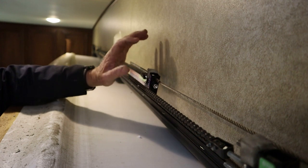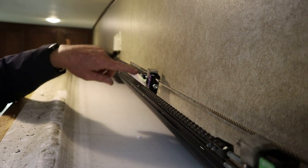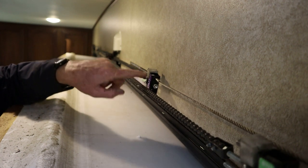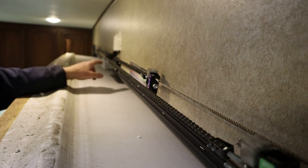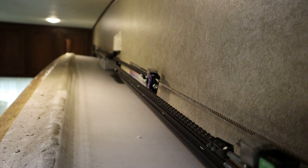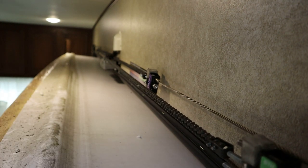we got the two cables come in at the top. There's adjusters on them. And then also in the center of these brackets, there's an adjuster. So I'm just gonna back those off so we'll get enough slack in these chains to change that gearbox. So you don't have to take anything completely apart typically, but you do just have to loosen stuff up a lot. So let me go grab some tools and we'll get started on that.